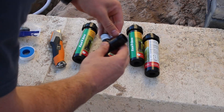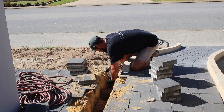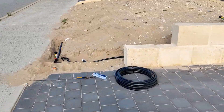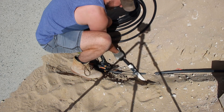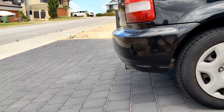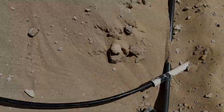The sprayers I'm using for the lawn areas are Rainbird 32SA gear drive rotary sprinklers. These are fully adjustable — they can rotate from zero through to 360 degrees and have an adjustable throw distance. One challenge was getting a 19mm retic pipe through conduit installed under the driveway — it kept snagging. In the end I had to buy a cable snake from Jaycar for 30 bucks, which did the job. I may not even use that 19mm retic but it's there just in case, capped off on the other side of the driveway.